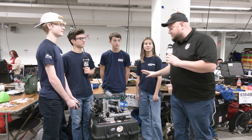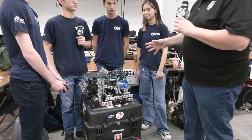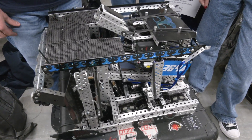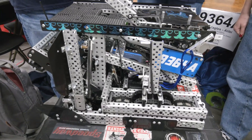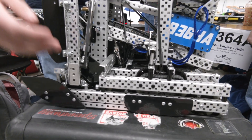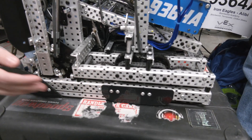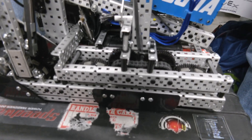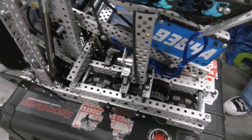Dan, let's start off talking about your drivetrain. You're doing something cool with how your whole drivetrain is separated. At Haunted we noticed getting over the barrier was a little bit difficult because we were back heavy. So we decided on this next iteration to move the two front wheels forward and leave a space, and then it just glides over a Lexan piece. That has been a lot more effective at this tournament — you just hop right over the barriers and tip forward.